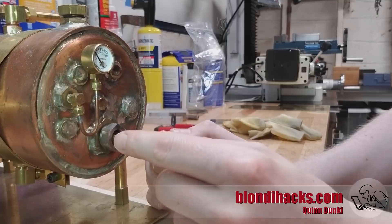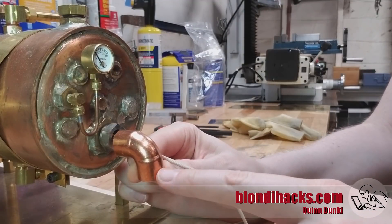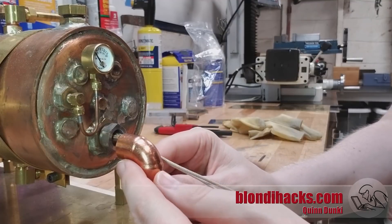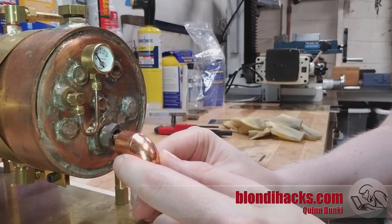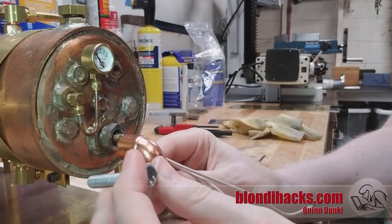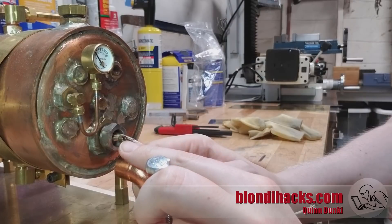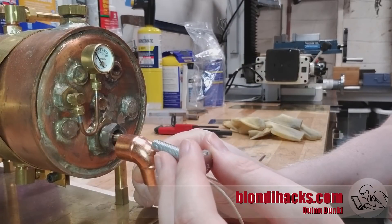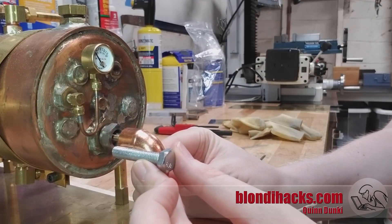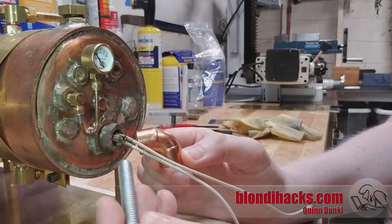I want to hide this stuff because I don't like the way it looks. My thought was to use a nice little copper pipe with an elbow here, then run a vertical piece down into the base, and the wiring can run under the base to the other end where the electronics are. The catch is that if I put this elbow on and run the wires through it, I lose access to the adjuster screw. So the solution I came up with is an adjuster knob that fits over the end of the adjuster screw — keying into its screwdriver slot — and runs out the back of the elbow. The knob runs inside the elbow while the wiring runs down through the bottom, so they won't interfere with each other. That's the plan — let's see how it works out.